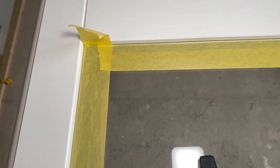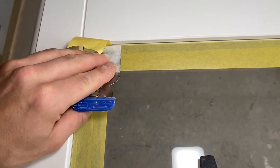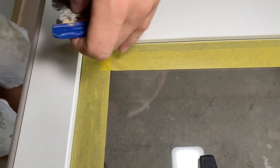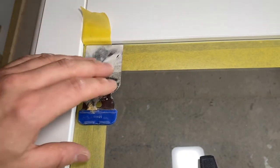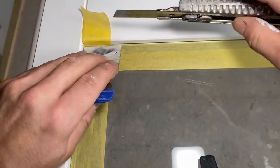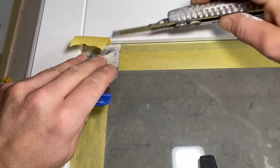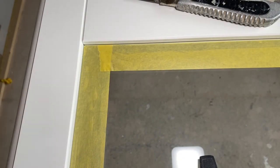The magic trick of masking taping is the filler knife — a thin blade. This is what I use for wood finishing. You just squeeze it into the corner, press it down with a new blade, and bang, you just cut it out. You have to do all the corners of every glass panel.